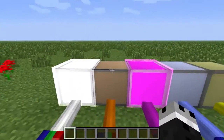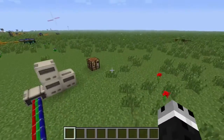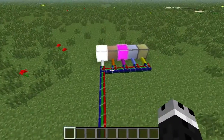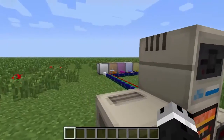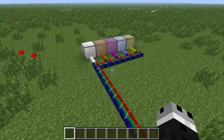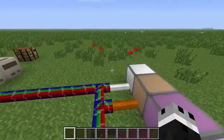It would be pretty much impossible to try to memorize every single number, so if you check the description I'm going to put a list of all the basic numbers so you can use the IOX set command. The easiest way to turn off all values is to do 0 IOX exclamation point, and that's going to turn everything off. I don't use IOX exclamation point that often unless I just want to turn off all values.